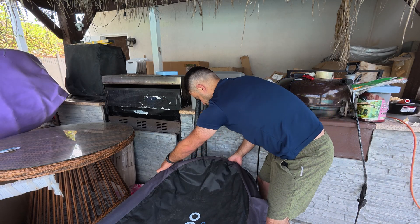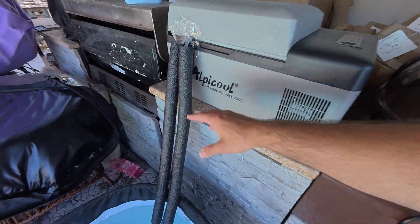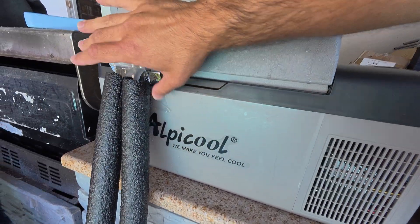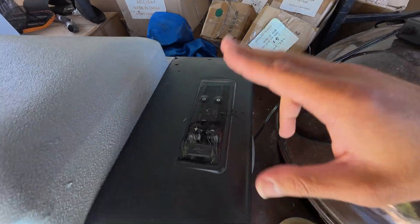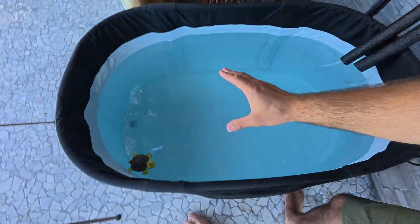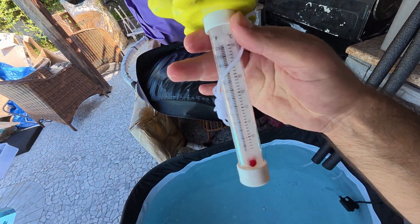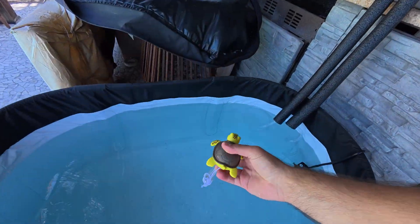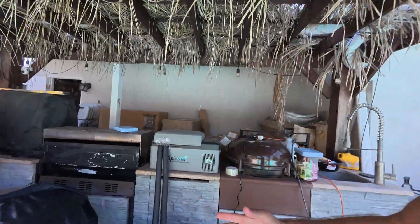It is now the next day. I added insulation to the piping, sealed up the gasket with tape, and let the new system run overnight. Right now the fridge is sitting at about 50 to 51 degrees, and the cold plunge itself — I can already feel it's pretty cold — is also at about 51 degrees. That's a good 10-degree drop from the 60 it was at before.